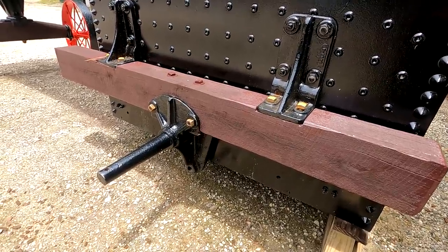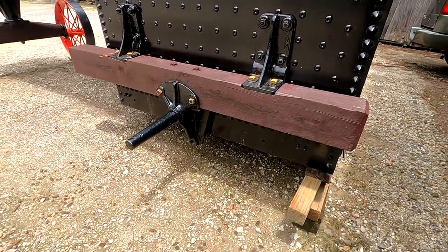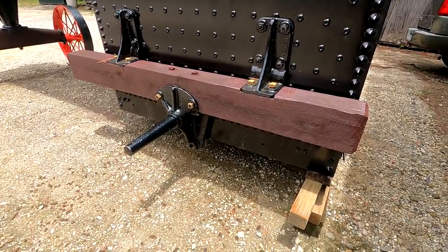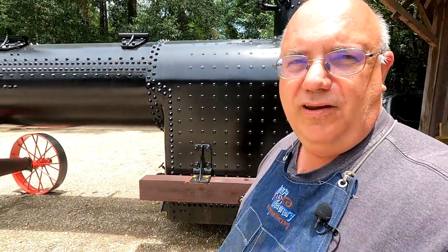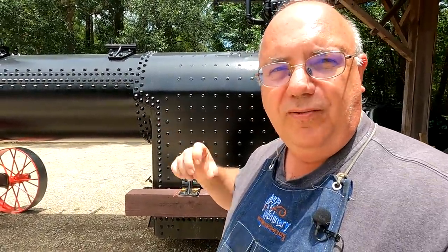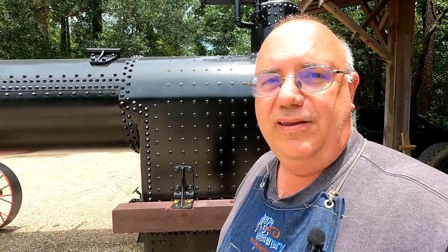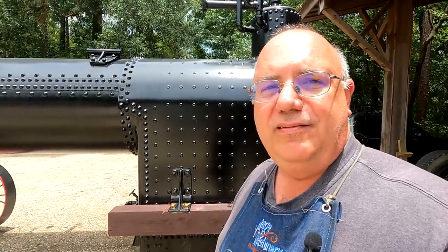What I've got is some inch and a half round stock. We're going to turn a shoulder on either side that fits up between those two pieces, then thread the ends so we can put it in there, put some nuts on and tighten it up. So we're going to go over to the metal lathe. I'm going to do this project out here at the museum using their lathe — they've got that big Lodge and Shipley lathe with a through-hole in the spindle that the inch and a half stock will fit through. My 16-inch lathe at home is just under inch and a half. Let's go get it done.